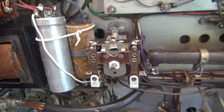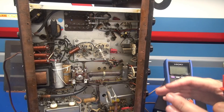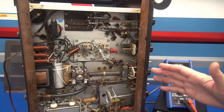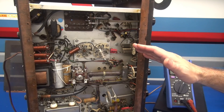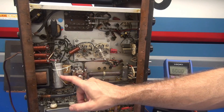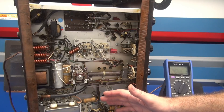Before I fire it up, we're going to have to get those caps out of there so we can safely bring up the high voltage. The other thing I need to test is that modulation resistor. So, your Viking 2 arrived and you're all excited to fire it up — but you need to approach this with some caution. First, pop the covers and give it a thorough inspection. Make sure the tubes are seated and all there. Take the bottom off and ensure nothing came loose and is shorting out the power supplies, because that could be detrimental.